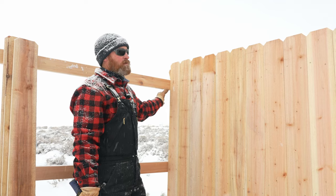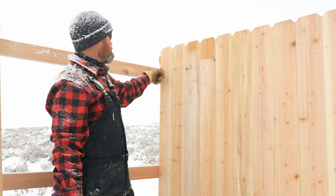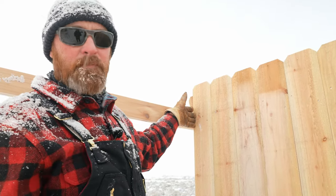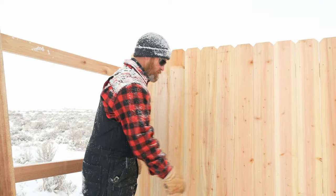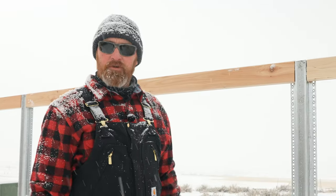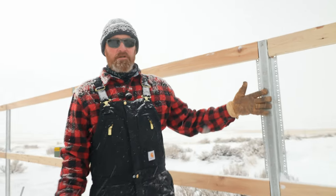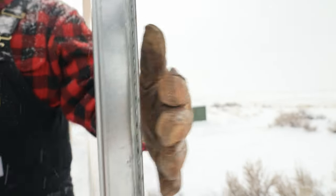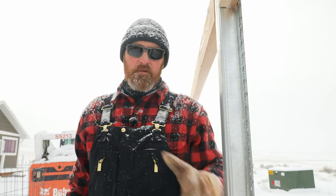One of the problems with the Postmasters is you do have metal posts back there and nails don't go into metal worth a darn. This picket on this side will overlap this edge because I can't get a nail up here — it's metal. So we have nails here and here, here and here. There's no concern about not being able to get a nail because this other picket will butt right into it and hold it secure. Hardly noticeable — if you didn't know you were looking for it, you wouldn't notice. Then you don't have that weird little sliver of a picket. Just decide which side you want your pickets on so you have a better chance of being able to nail your pickets. Make sure you plan ahead — know how you're going to face your fence and make sure you have the pretty side out front and the less pretty side on the back.